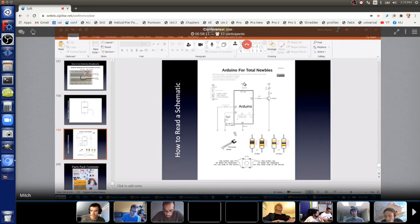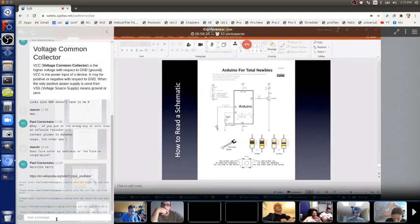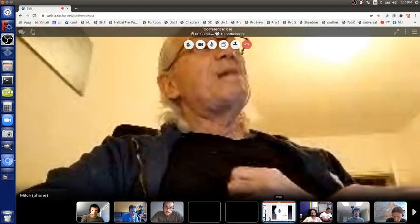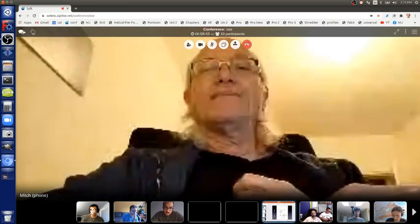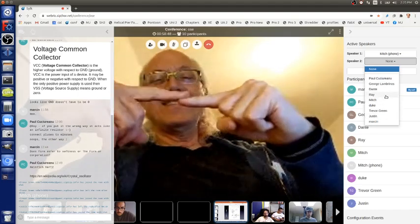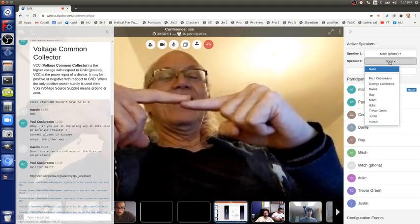Let's look at this. Here's pin D2. There's a wire coming out of the pin D2 hole going to the right side of this part. The left side of this part has a wire going, you've seen this before, ground. So we have to connect a wire from the left side of this part to the black wire of the power supply somehow, ground. This part is a switch. And remember, a switch, with my fingers, it's either on or off. On or off.